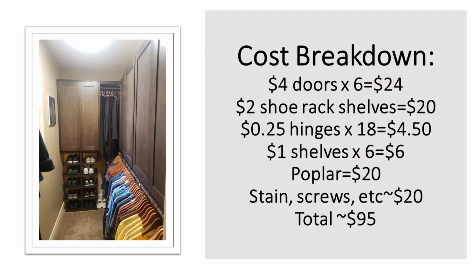When using reclaimed items, it's often nice to paint them because then it's easy to match things. But in this case, I loved the look of these doors. So it was a kind of a unique color though. So in order to match the trim to it, I found that poplar wood, which has a greenish hue to it, with ebony stain over it, worked out really great.